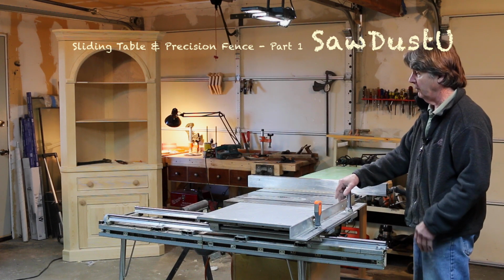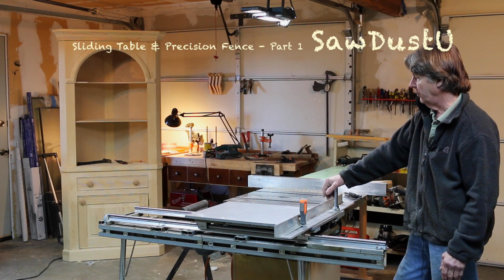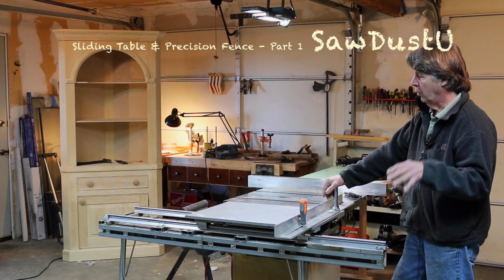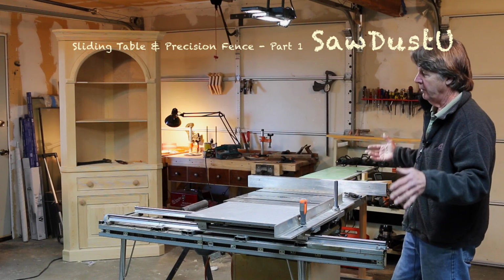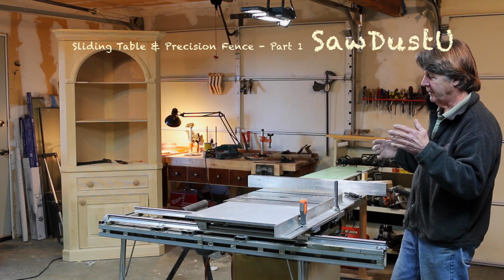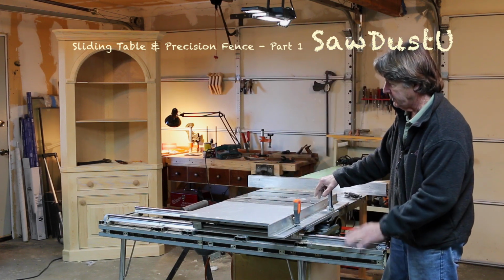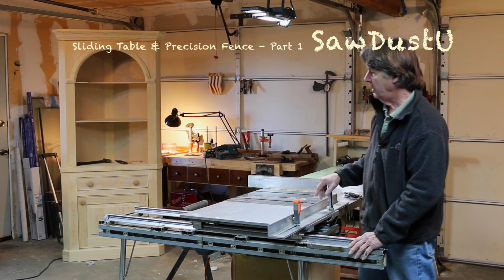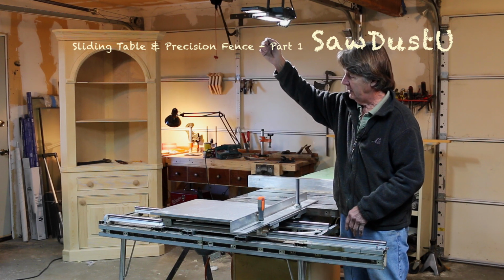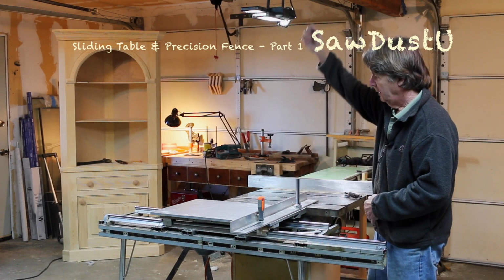A quick note too about the larger sliding tables that are designed to cut sheet goods, 4x8 plywood or 5x5 Baltic plywood. And the problem with that is that if you're a single worker in your shop, hoisting around a 4x8 sheet of 3/4 inch plywood, particularly if it's pre-finished, which is all the rage now, the tendency to get it nicked or dinged as you move it around the shop is great. So what I did is I'd use this same idea outside here in the carport with these rails and a sled counterweighted mounted vertically rather than horizontally, and I can take my plywood right off of the truck, slide it right onto my framework, cut right through the blade.